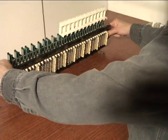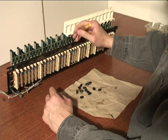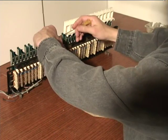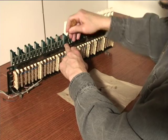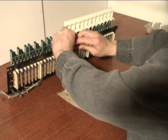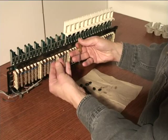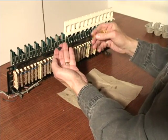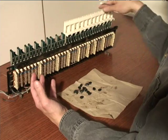You can flip the keyboard assembly up. Here's the key carrier — it's a metal tube — and there's also a little metal stop inside, along with the keyboard bushing. This came from the White Odyssey, so it's the one with all the squishy bushings — quite a big gooey mess. With the screwdriver I'm trying to pry the old bushing out. So this is what the bushing looks like: it's simply a tiny little rubber grommet. Everything is quite gooey and messy.